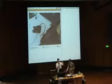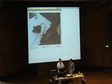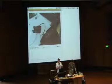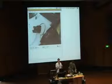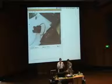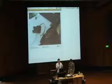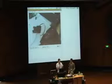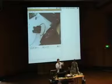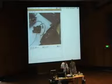So over here, somewhere we have a servo. For those of you that haven't seen these things, these are very, very cool little devices. Basically, it's a box with a little knurled knob sticking out of it, to which you can connect a variety of different things, like little discs with slots in it and arms. These are really cool if you want direct control of physical devices, so if you want mechanical control of something. And they come in a wide variety of sizes. This one's a relatively small one. It's typically the sort of thing you would find in a remote control car or a radio controlled aeroplane. But you can get them up to very large sizes with huge amounts of torque. We'll get to PWM in a moment, I'll explain that later. But basically you can control the position of the arm. It's not like a motor that simply spins when you apply power. It's an actuator where you can specify the position that you want to move it to. So what I'll do is connect that up as well.